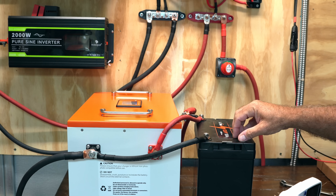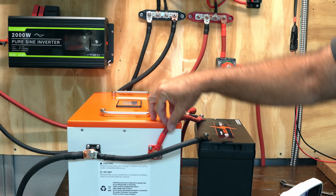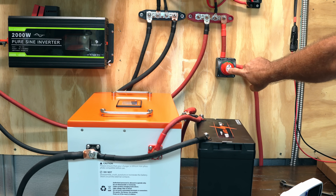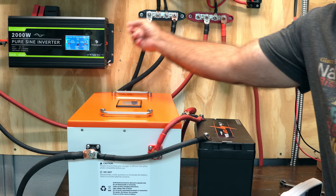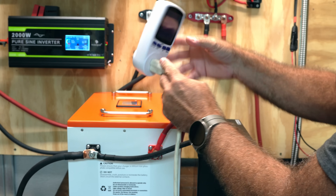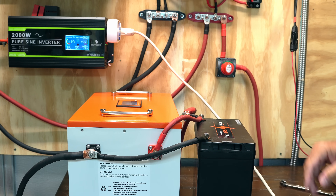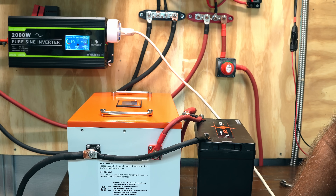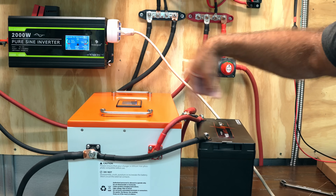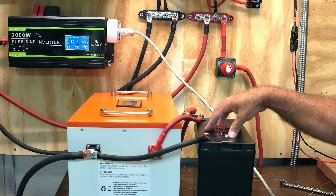We've got all our connections here: the negative from this battery going to the negative of the other battery, with a larger cable going out to the bus bars to feed the inverter. The positive from the big battery goes to the positive of the small battery, and on the other side of a fuse the red cable goes up through the disconnect, which is currently in the on position. We're going to fire up the AC inverter and apply a load from an oil heater. We'll use this watt meter to log how many watt hours we actually get out of this unlikely combination. We're pulling a little over 1,100 watts. Let's let this run all the way down until one or both BMSs shut down, and find out how many watt hours we get out of this combined 460 amp hour plus 100 amp hour battery combo.